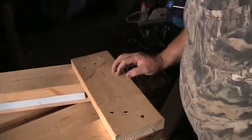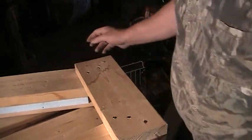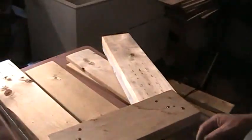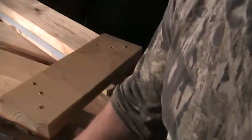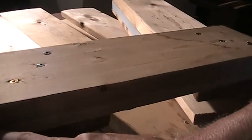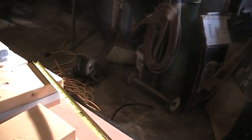Okay. You've got the layout like so. Now at this end, you put here into here on the long 2x6s and the short one. Now you only put one screw in there at first, because what you got to do is make sure from the end of the 2x6 to the outside end of that one, it's again 28 inches. And you got to get it sort of even.